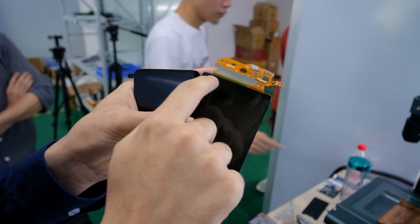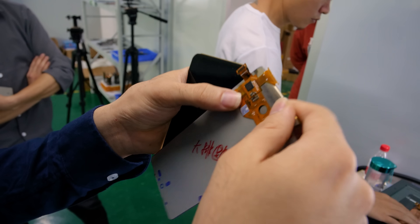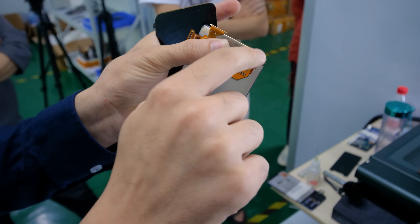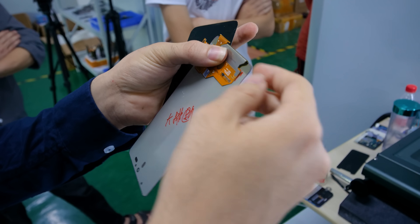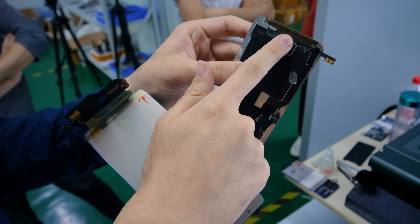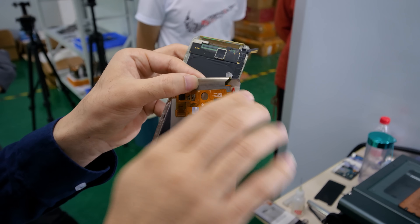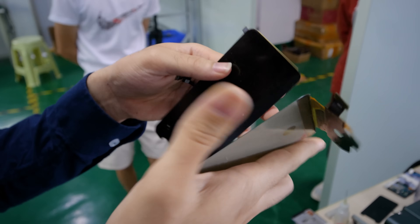This is the hard type and this is the soft type. With the soft one we can actually bend the glass itself. With the hard one, the bending flex point has to be in the front — we attach the flex in the front and bend it to the other side, so the part that's bending is just the flex. Those two edges are very easy to get dirty, get water damage, or get broken. With the soft type, the glass bends over to the other side so you don't have sharp edges like with the hard type.